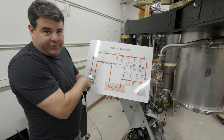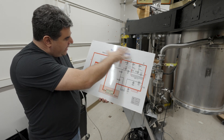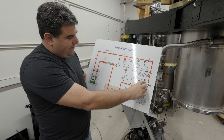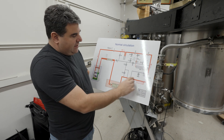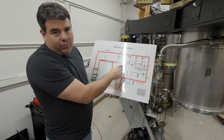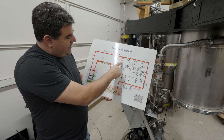The problem is when you put air into the dilution refrigerator down here, it will freeze and plug the dilution refrigerator, and we won't be able to cool down. Before we can start cooling anything, we need to evacuate all of this system so it's got a high vacuum in it. The helium-3 is incredibly expensive — it's living in these kegs, but there's some of it probably between the circulation pump and the keg. So what we'll probably try to do is pump everything from here over, not pump this, and then hope that this cold trap — a liquid nitrogen cold trap — will condense that mixture out before it gets in here and plugs up the fridge. This may take multiple attempts to clean the mix.